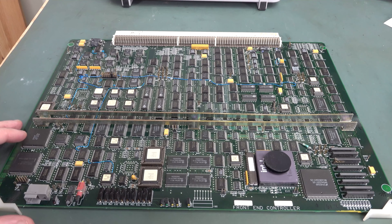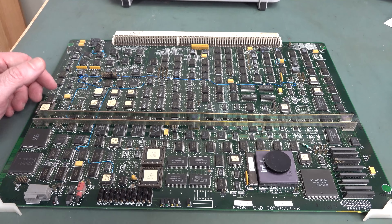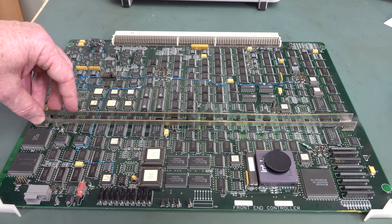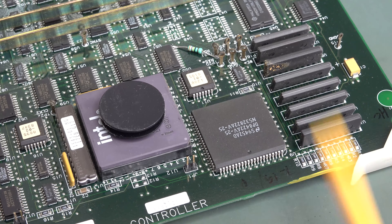Check out the front-end controller board — isn't it gorgeous? I just love seeing densely packed digital like this — all the chips in rows, lining up, pin one always in the same orientation. No higgledy-piggledy. Occasional horizontal ones for memory. It's gorgeous — I'm a digital guy. This is a 12-layer board — unbelievable. Cost doesn't matter here. We've got an Intel processor down here — not sure which one, I'd have to get the heatsink off. There's a NatSemi part doing some sort of processing — did NatSemi do DSPs?